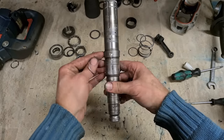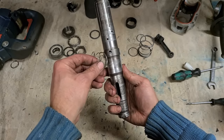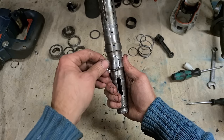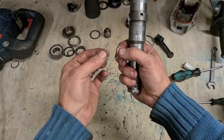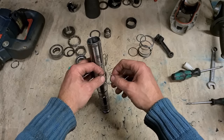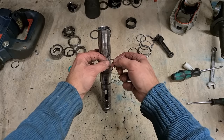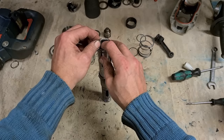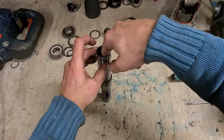When you're installing, see there's two high and two low holes, same as when we're taking it off. Make sure the open end is at one of the high holes. So the two lower holes are here and here. So if you ever have to take this out again, if you're doing another service, it's easy to take out. If you have it sitting like this, you'll have no leverage to prise this up. It'll be very difficult to take out. Push it in and down.